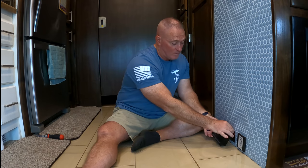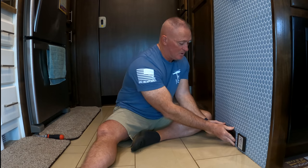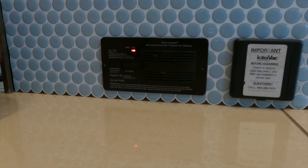Once you check it, it's easy to put back in — just a couple screws. And then it's always good to test it. What you're looking for on your CO detector is a green light — it means that everything is good. When this goes off, you're going to get a red flashing light. Normally when it goes bad, it happens at about one in the morning when you're least expecting it.